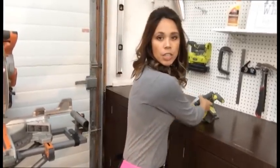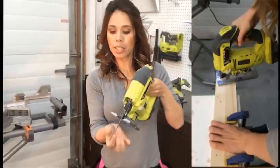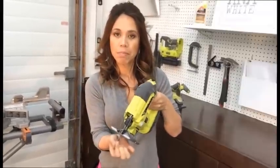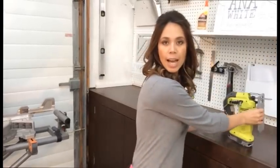For cutting curved cuts, you'll need a jigsaw. But a jigsaw is not as precise as a circular saw because the jigsaw blades can actually flex and bend as you're cutting, giving you a beveled cut. So you'll want to invest in a jigsaw for curved cuts, but it doesn't necessarily replace a miter saw or a circular saw. Table saws are nice to have — I have one and I use it all the time — but I don't think they're essential for a first or beginner project, and they're kind of challenging to use. I'd invest in one as your woodworking skills improve over time.